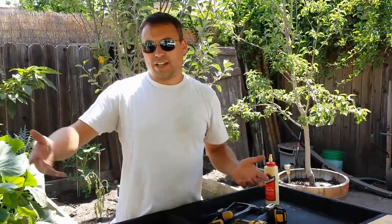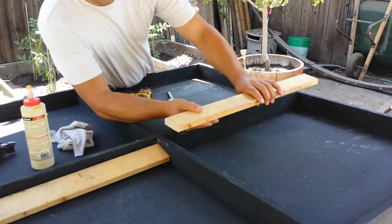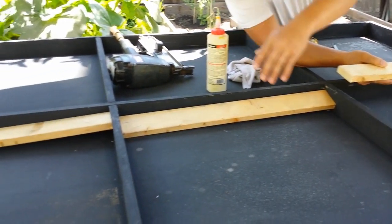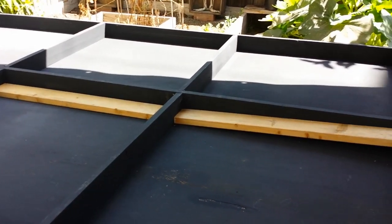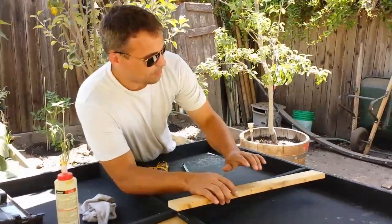These walls that we're working on are actually 10 foot tall, but my jacks are only 8 feet tall, and it didn't need to go the full length. So whether you're making an 8-foot wall or a 10-foot wall, your jack doesn't necessarily always have to go the full distance. Okay, so you can see I've taken the liberty to cut all my 1x3 that's going to be going up the flat. I've got to basically glue and shoot all these into position, and then I'll drill the holes, and this will be what the jack basically will go up against to hold the wall up.